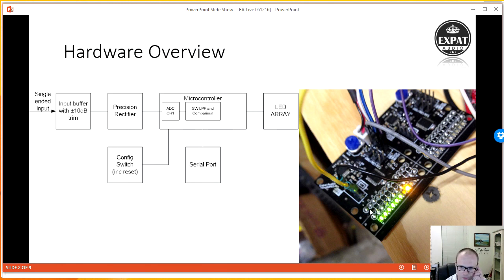transfer the signal over. So I'm sorry, let me say it the other way. If you're willing to put this whole board on your front panel, then it's very easy, just put some wire bonds between them. But if you only want this board on your front panel and this deeper in your case, which in my case, I want the VU meter to take as little front panel space as possible, then I will cut this out along this V groove and use a ribbon cable between one and the other.